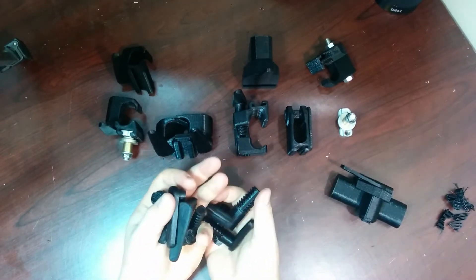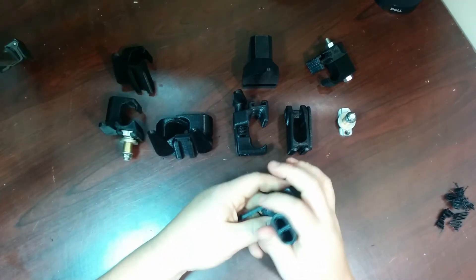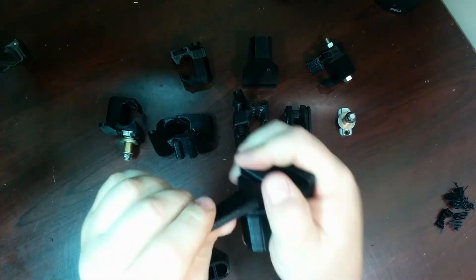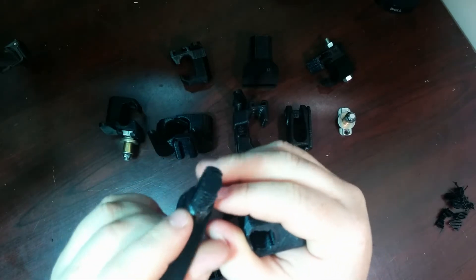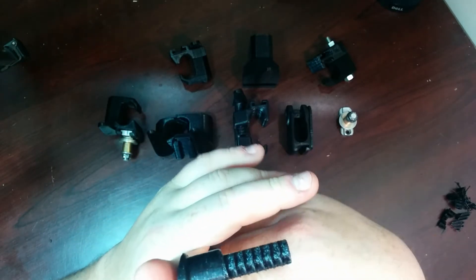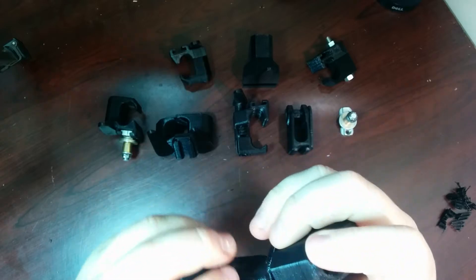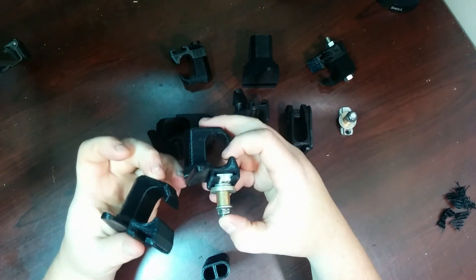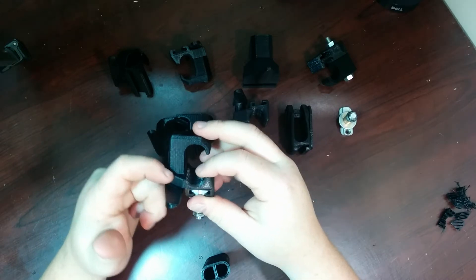That was one of the issues at the beginning of the design. I said I'm going to make this work and keep working on the design to give it more strength. I found out you could print these not flat — I printed them at a slight angle, and that did give it more strength, maybe 20% more. But it was still susceptible to breaking. I also made a version where the arm is a little bit thicker, thinking it would give more strength. It did, but not too much. Still, the crack propagated right where the split was.